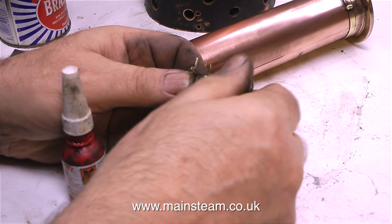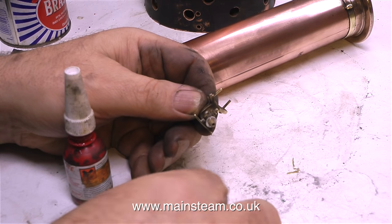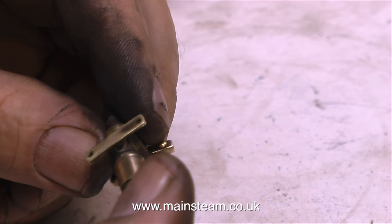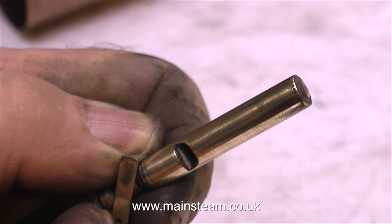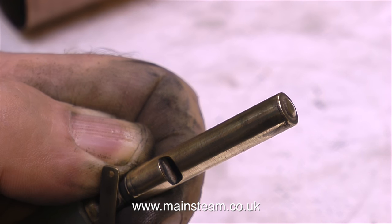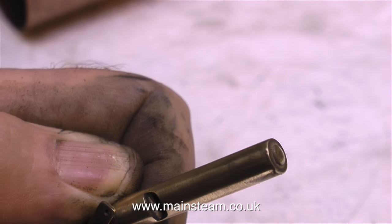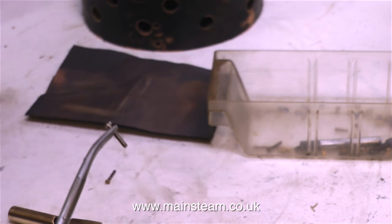They have to be clean — it's no good having dirty marks showing where things have been removed and put back. This small, well-made, but almost ultrasonic whistle needs refitting to the thread on the valve, and to seal the thread I'm using some Loctite 542. The whistle blows quite well, but only on low pressure. But thankfully the pipe that feeds the whistle is very, very thin, so that hopefully will drop the pressure sufficiently and avoid the frequency going ultrasonic and attracting every dog in the neighbourhood.